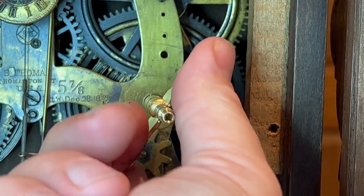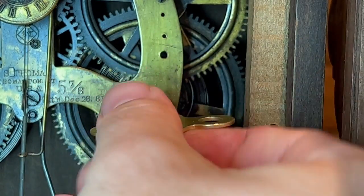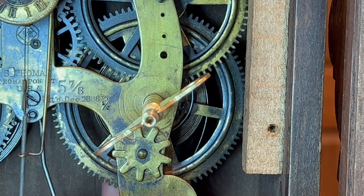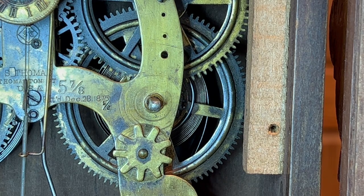The clock is fully wound when I can't wind it anymore. The question is where is the point of being overwound — is that even possible? The short answer is not really. Unless I use an extreme amount of force, it stops when it's done. I've reached a point where I can't wind it anymore, and this is what the spring looks like — tightly wrapped on the inside with a fairly solid stopping point. This is a fully wound spring and this is absolutely normal behavior. Typically you wind it every week until it's tight; on a pocket watch, every day the same thing. Use a reasonable amount of force — you don't have to crank on it — and when the clock is fully wound, that was as the manufacturer intended.